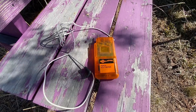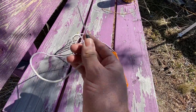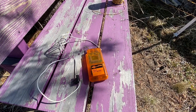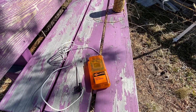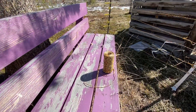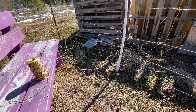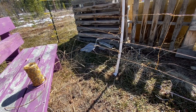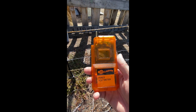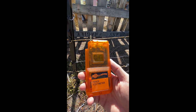Here's my charger and my Gallagher tester. It lets me test the ground and the hot wire — you touch the hot wire on here, then put this either in the ground or on your ground wire, and you want this to read as close to max as possible. My charger is 12kV max and I'd say 90% of the wires produce a 12kV shock. I just buy rolls of galvanized electric fence wire — I think it's 14 gauge — from Home Hardware fairly cheap. You should test your fence at least once a month, especially after windy weather or if the fence looks damaged.